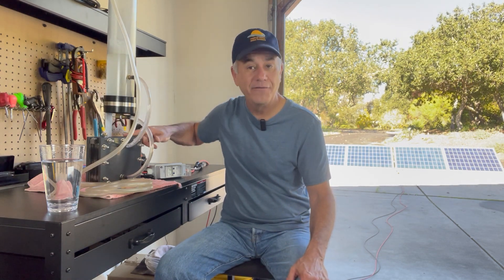Now that I'm into solar, I've actually got a couple panels — these panels you see behind me here. These are just some super cheap 140-watt panels made in China. I picked them up off a local guy on Craigslist for about 50 bucks a piece, so I just use them for experimenting. They run at a higher voltage — 43 volts each. I had to configure it with the two outside panels on each side wired in series, and then those two pairs in parallel. It was running about 80 volts at the solar panels, but by the time I get down here, between the line loss and the fact that my cell is cold and the electrolyte might not be that strong, I'm only pulling about 50 volts at the cell.